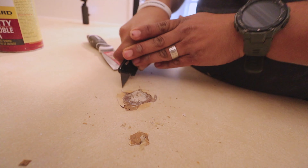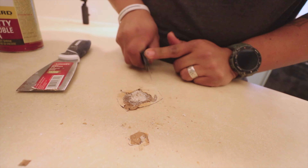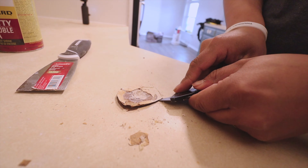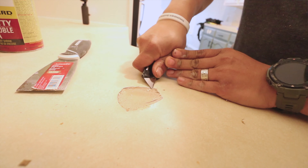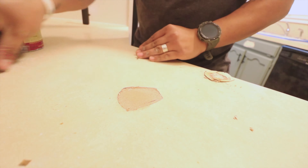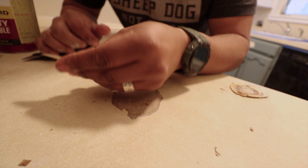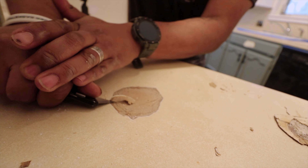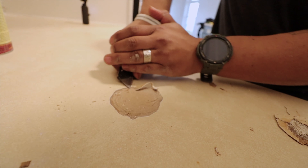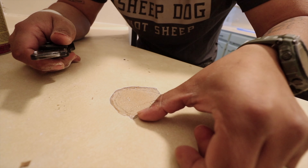Just use the spatula to scrape off the little pieces that were already bubbled and broken, as much as possible. I'm cutting away the bubbled area so that it doesn't stick up and isn't at a different height than our regular countertop. We made it a little bit bigger because it had bubbled up. I'm using a regular utility knife and I went in at an angle to try to get that down even more.